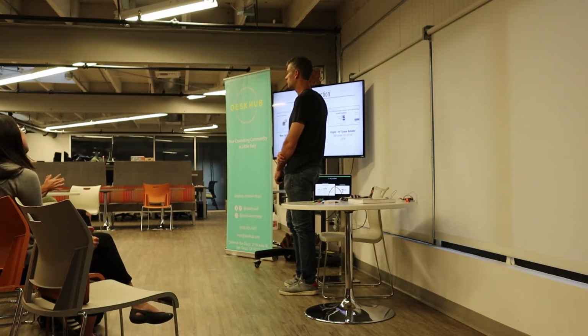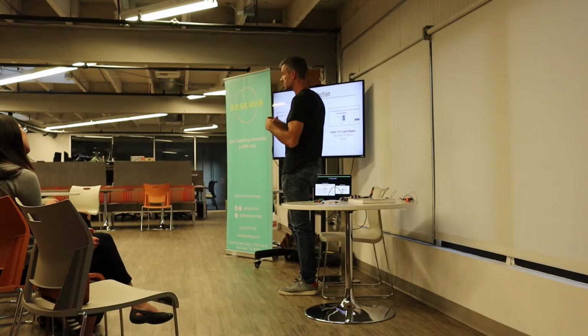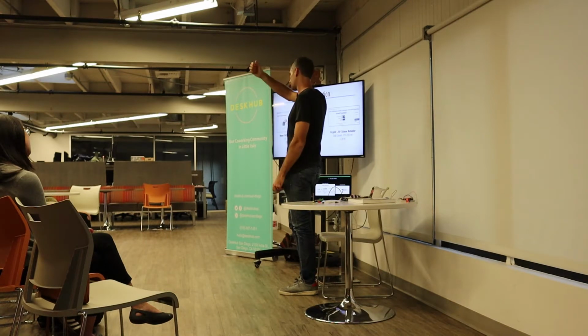What's your mental calculation? So you end up drawing a really simple free body diagram. So this is the mechanical engineering side of me. You can simplify it down. So for torque, you're calculating force at a distance away from your rotation point. So if you simplify it to, for instance, the torque that we needed on the big flowers, that was just looking at how much force we had to pull.